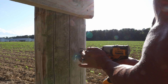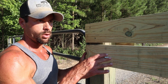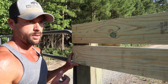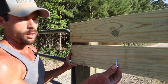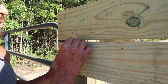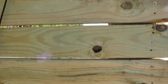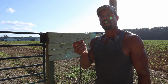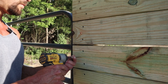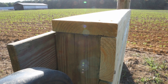The quick clamp didn't work too good on the light pole so I'm going to just use a screw to hold the next board up. I want a little bit of an air gap so the wind can pass through without much issue. These boards are going to shrink as they dry some but I'm going to go ahead and use the quarter inch bolt as a spacer right now. I'm going to put one at each end as I secure it and that'll create a gap to let the air pass through. Then I'm going to use some of these GRK style structural screws for a little extra support. They're not exterior grade but it'll be okay for this.